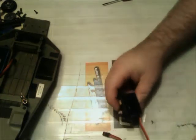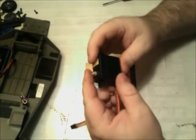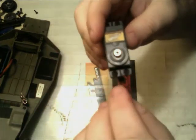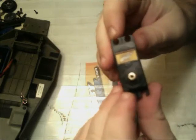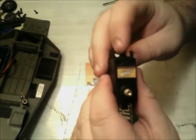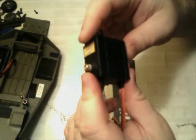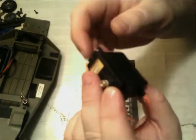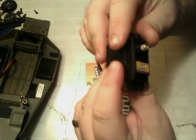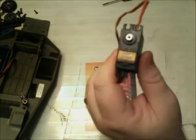Since I've already done that, I'm going to go ahead and put it back together. Now that we've got the servo back together, we're going to proceed with the next step, which is the Plasti Dip stage. There are some areas we don't want to get Plasti Dip on, like the mounting tabs on either side and definitely not the splines. I don't like to get Plasti Dip on the servo labels either. Our main target areas are just the seams around the case. So I'm going to take some masking tape, mask this thing up off camera, and then come back after it's masked up to show you guys the rest.